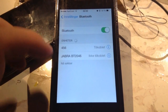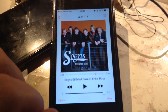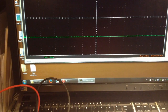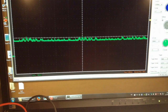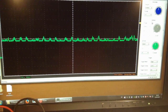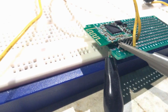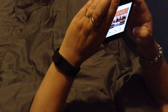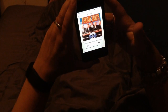One thing we learned from the forums is that the audio ground is not really zero — it's 0.9 volts, so you have to be careful not to connect it directly to the same ground. It doesn't matter for this scope because it's electrically isolated from the power supply I'm using — a bench power supply. But when we connect it inside the Tivoli audio table radio we have to be careful, because then the ground is not isolated from the amplifier. You can see it's working — really cool. I connected it to Bluetooth as if it were a Bluetooth headphone.